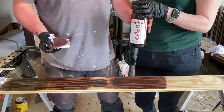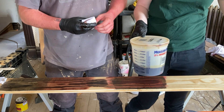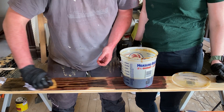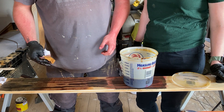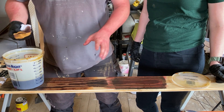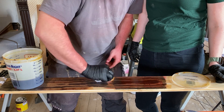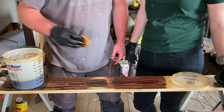Let's switch — take the actual shellac. We've got as much color as we really need to put into it. That just took it to a really strange place — it almost took color out of it. I wonder if the alcohol is eating the color; maybe you'd need to let it dry for a few hours before adding shellac. Let's hit this other spot. Stain is supposed to dry a few hours before you do anything — but I've never mixed shellac and stain at the same time. We're just experimenting here. It made it very warm but also a little pink — this mix is not it.